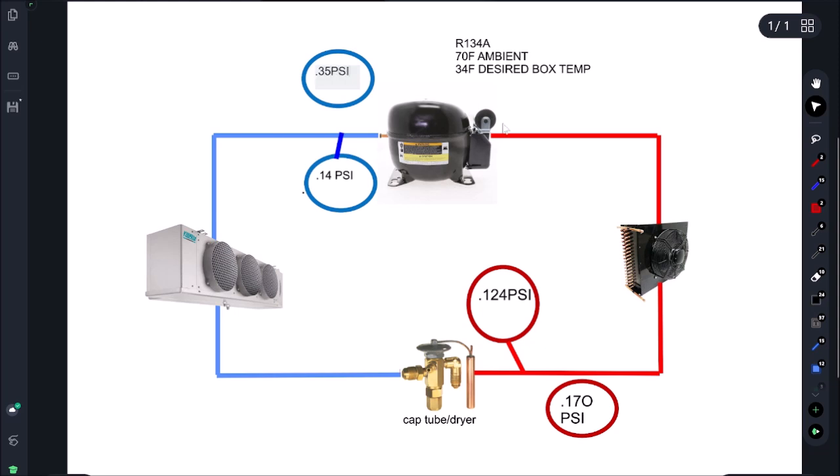The next combination: high suction and low head. Let's say we have 35 psi suction and 90 psi on the high side. When we equalize the system, let's call it 70 on both sides. Once the compressor starts, the suction pressure should pull down and the head pressure should bump up — assuming the charge is good.